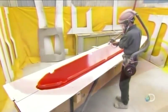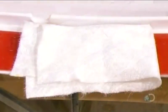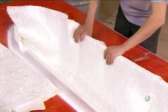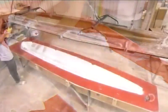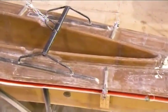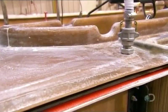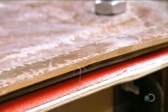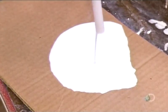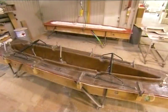The factory molds the top and bottom halves of each floater separately. First, workers spray the mold with gel coat, a type of polyester. Next, they cover the entire mold with fiberglass cloth, then add a second layer in the front and bottom, where the floater will be a bit thicker. Then they lower a cover onto the mold, latching it down securely to make the mold airtight. They draw a vacuum to extract the air trapped inside, then inject liquid resin. The resin saturates the fiberglass cloth and, within an hour, hardens, producing solid fiberglass — a lightweight material that's both impact-resistant and waterproof.